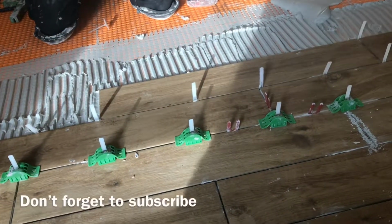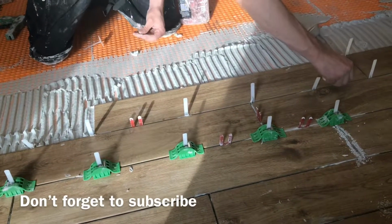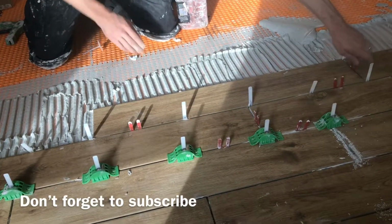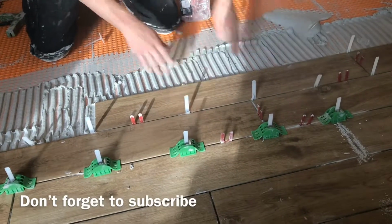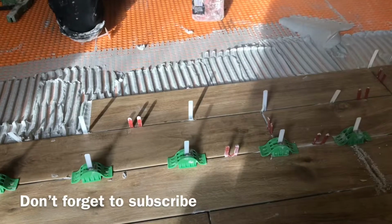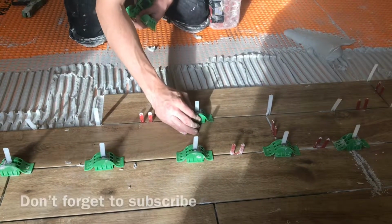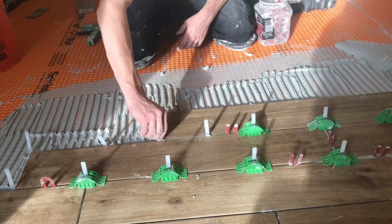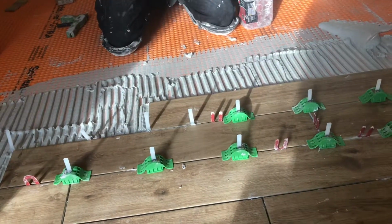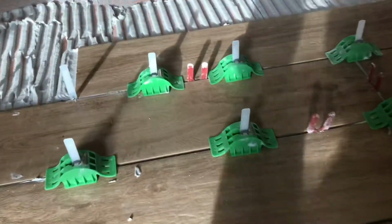We're using a 1/8 inch grout joint, so it's imperative that our tiles be really flat and close in height to adjacent tiles. And then sometimes we've been discovering since yesterday that the ends might need an extra cap just to help keep it planing out. I'll zoom back in here again.